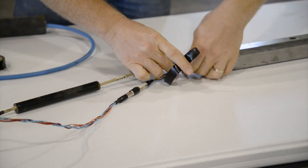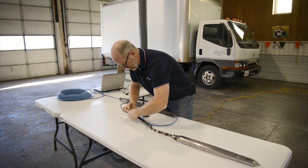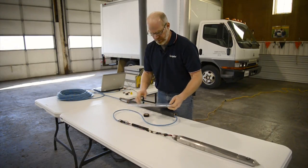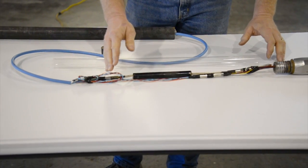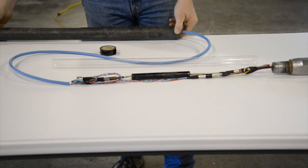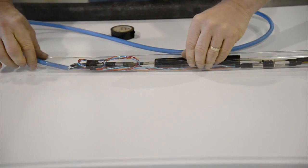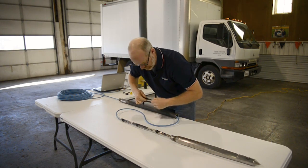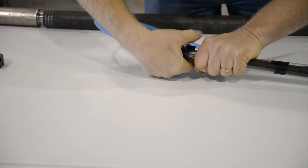In order to fit the connection tube over the power module, you can do some overlapping with the wires, and you can bundle the loops using electrical tape. Covering the wires and power module with a liner can help protect them from potential damage. During the hammering of the probe, bare exposure to the inside of the connection tube could cause the wire insulation to wear and short out. Using a liner that is sliced will help you easily cover the wiring tightly. After you make the fitting, seal the liner up using electrical tape.